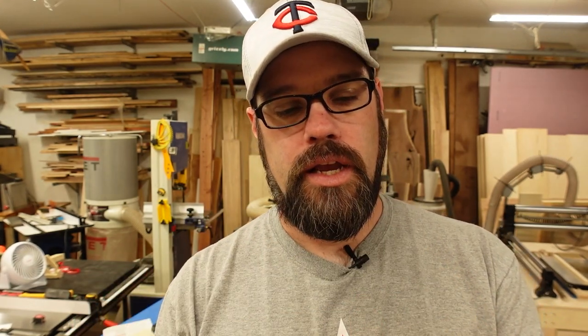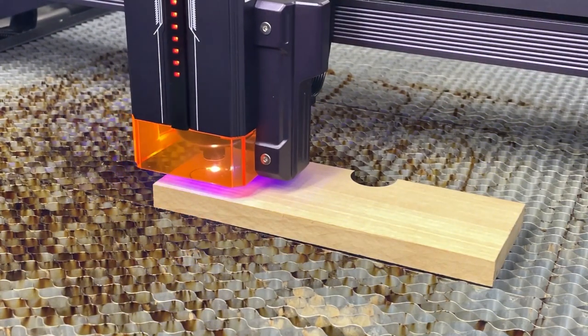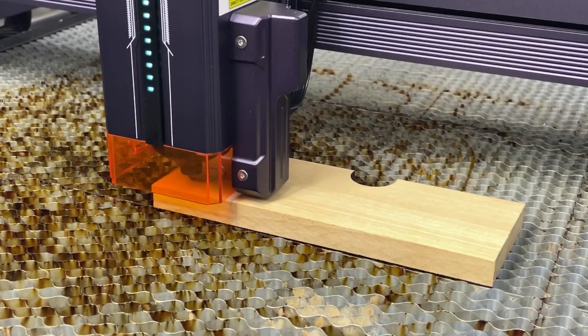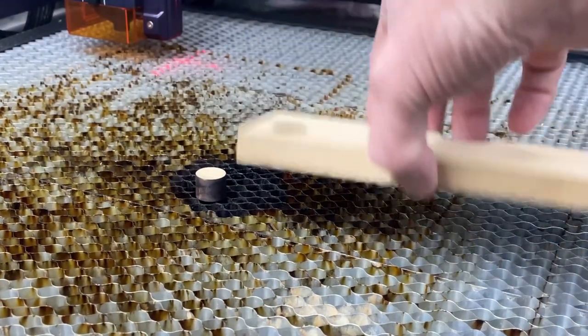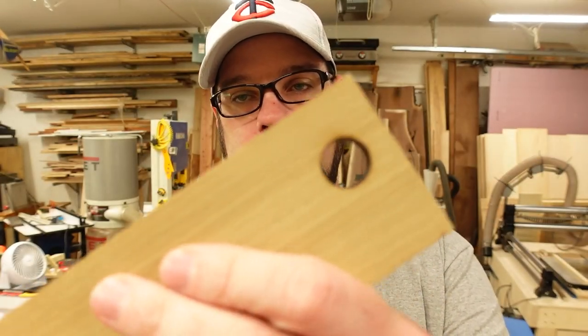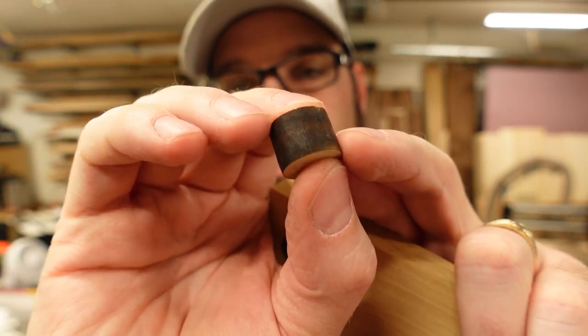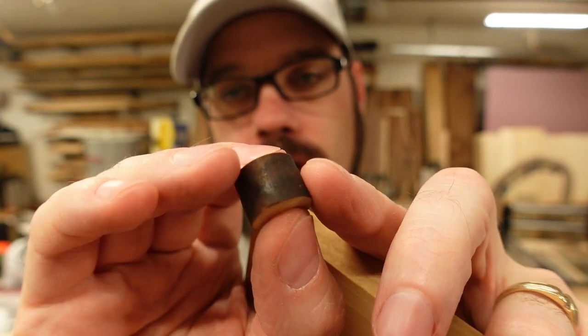The Z-axis step-down feature really shines here. Using denser half-inch material, I set it up for 400 mm/min, 100% power, four passes, and had it drop down about 1mm per pass to bring the focus point through the material. It cut through very cleanly — the top side is nice, the bottom has just a hint of overburn, and the cutout piece is very clean with just caramelization and minimal charring. Combining a faster speed, multiple passes, and Z-step-down in LightBurn makes this a very flexible machine for clean cuts in thick material.